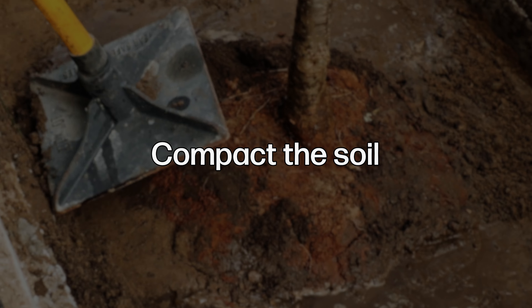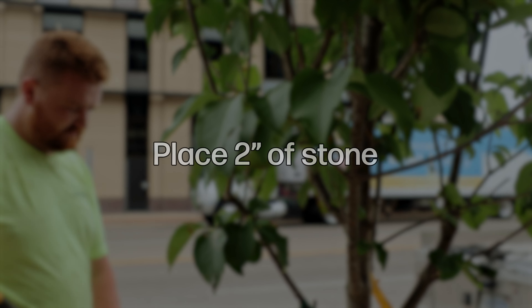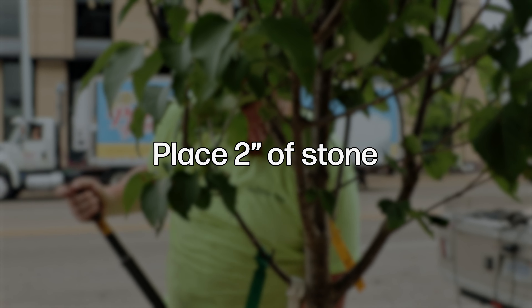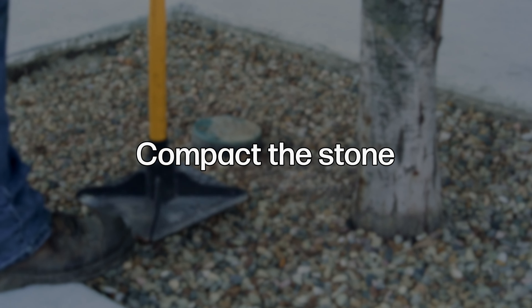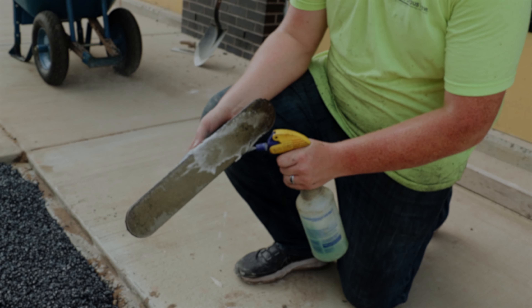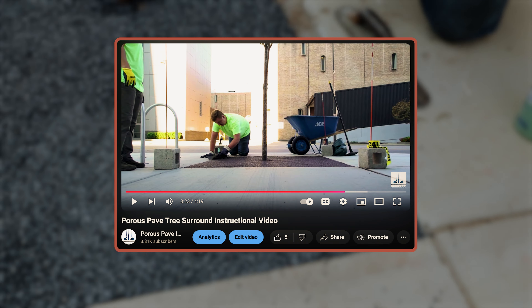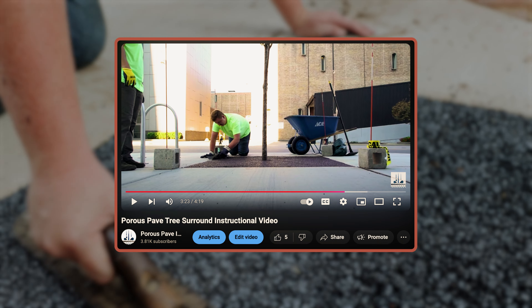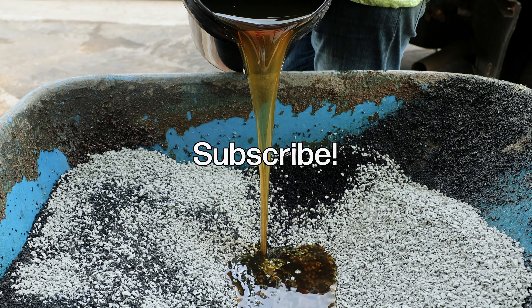Once the four inches of soil is removed, you can compact the soil with a hand tamper or a plate compactor. Then place two inches of crushed stone that is angular cut and low in fines as a base material. Once the stone is in place, compact with a hand tamper or plate compactor. Once the stone base is prepared, you can refer to our tree surround installation video on the proper steps to installing porous pave for a tree surround. Thank you for watching and please subscribe for more informational videos like this.